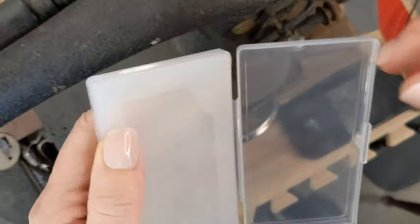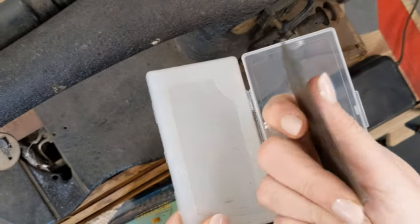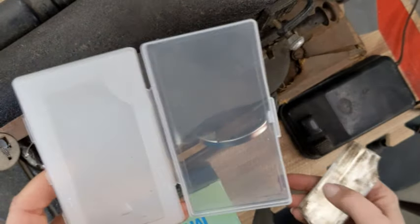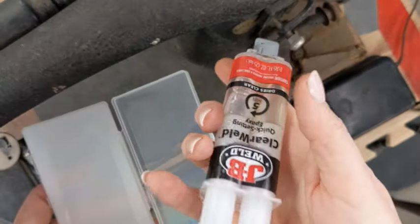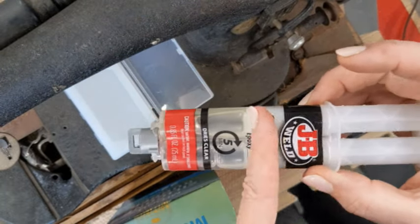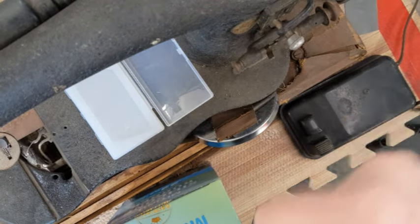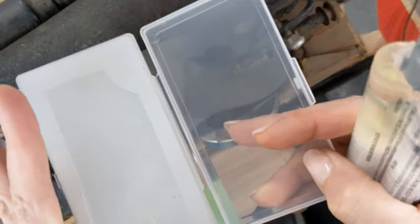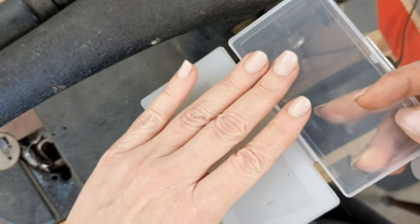So my thought was I can cast a slide plate. It's not going to be metal, obviously, because silicone won't hold up to a hot metal cast. But what I used is clear JB Weld. Again, this is just what I did in my first try. I might do something different the second try. It took about half of a container, and again, you put down equal amounts, stir them up very, very well to get the hardener and the epoxy mixed very well. And then I smoothed it in here, filled it actually a little over, and it seemed to shrink in.